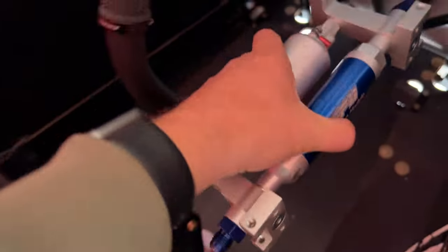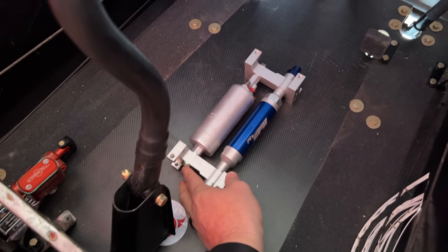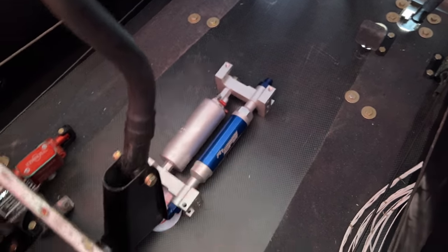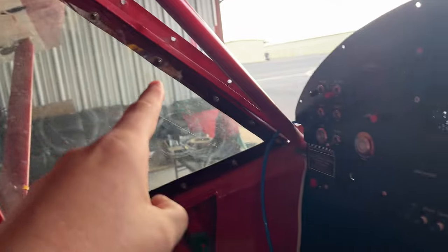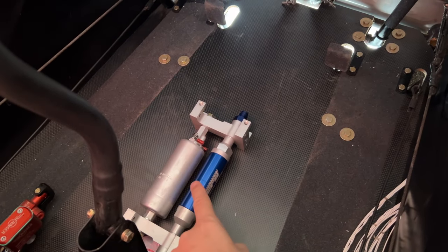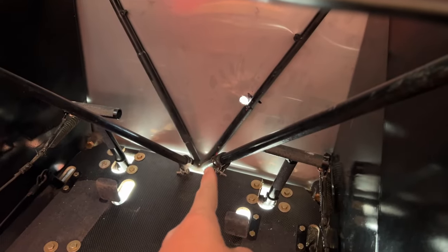This guy is going to go right there-ish — that is my current plan. I've got to do a lot of stuff to make it do what I want, but yeah, it's going to go inside the airplane, in between my legs. We're going to be having fuel coming from up over here, down that way, through here and coming up from each wing tank. Then we're also going to have fuel coming down right through here and back around and coming forward, so we're going to need some T's to join those that go up into a fuel selector valve that then goes through this whole system and forward to the engine.